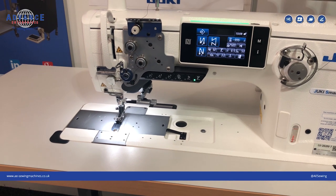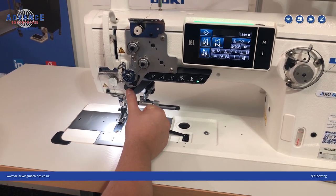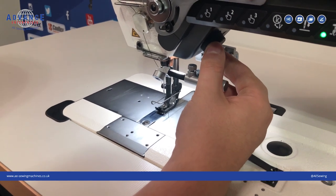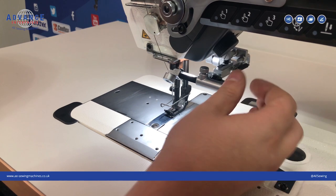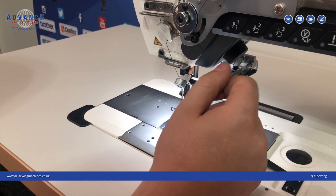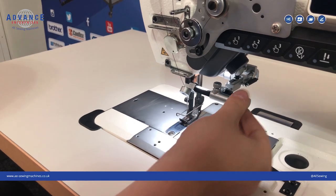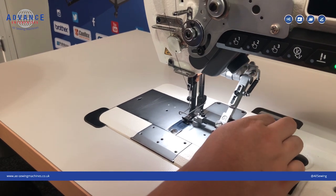Another important feature is we have the traditional back tack switch here, but we also have a very small dial which will allow the hand wheel to make micro adjustments. These micro adjustments can be made before or in seam, and if you want them to be very precise you can use this. We've also fitted a standard KG867 dropdown guide.